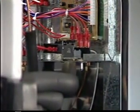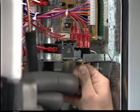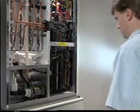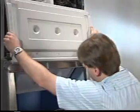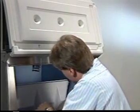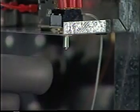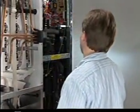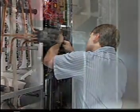Let's look at the bin control for any suspected problems or adjustments. A quick check of the bin control can be accomplished by switching the pump to the wash position. The unit will not start if the bin control is stuck open. When the bin control is stuck closed, the machine will not automatically shut off. If the bin control is not adjusted properly, it could cause the unit to shut down prematurely or allow ice to back up into the evaporator causing a freeze-up condition. To check the adjustment, access the thermostatic bulb, turn the switch to the wash position, and place a small amount of ice on the thermostatic bulb. If the pump shuts down within 6 to 10 seconds, the bin control is adjusted properly. Adjustment can be made with a screwdriver in the bin control slot.